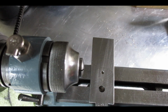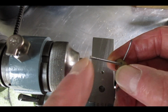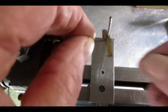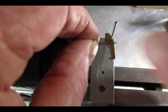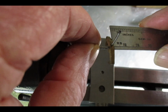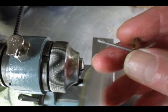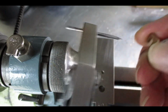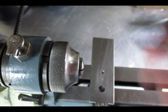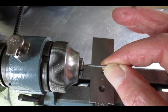Replacing a pivot on a torsion clock anchor, broken pivot, that end. So the first thing you need to do is determine how far on the anchor goes, which is just with a ruler and measure it. Once you determine that, you need to remove the anchor. Just twist it till it comes off. Then that gives you the whole arbor to go into the lathe.